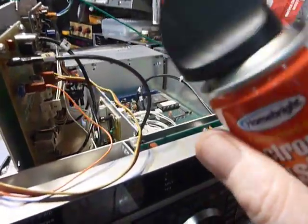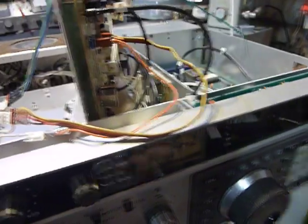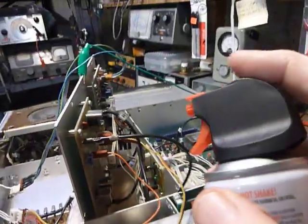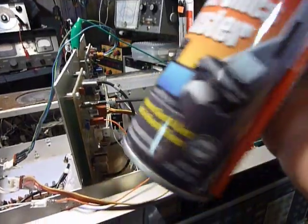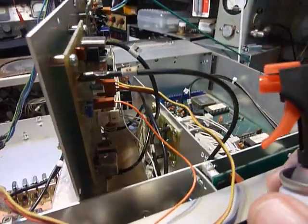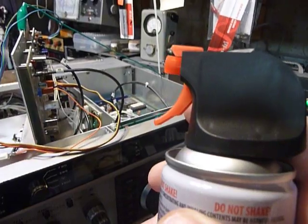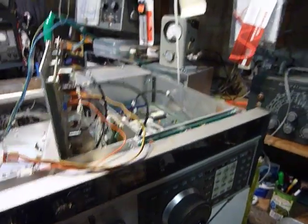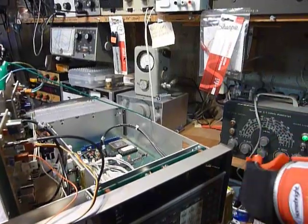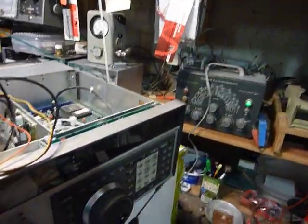The way you use this, you can spray it as-is — it's not an air blast, it's a type of Freon. You can spray the cold Freon just like it's designed. They give you a little tube you can put in there, and you put it right up next to the part you want to cool and spray it. But if you want to get the liquid out like the big freeze spray bottle, you just turn it over and the liquid comes out. There's probably two or three ounces in there — enough to do a job.